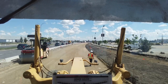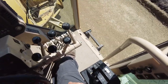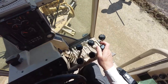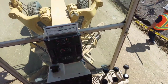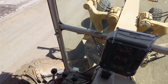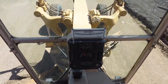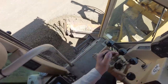That's Trevor out in front of me, measuring off the string. I've got the camera mounted to my hard hat. There's a grade mark. By the way, this is 20mm gravel. I'm going to make sure I leave these numbers — don't take the numbers out. Just leave them until you get level. That way, you can utilize those numbers in the next step.